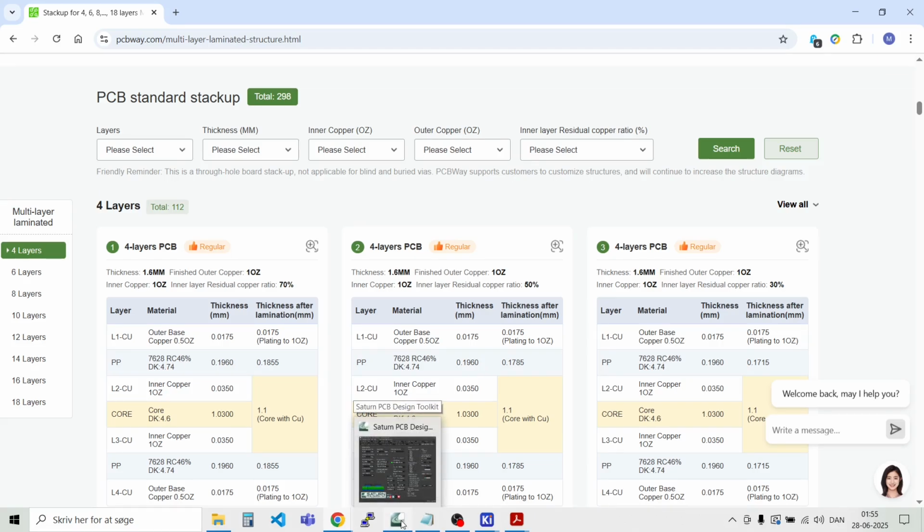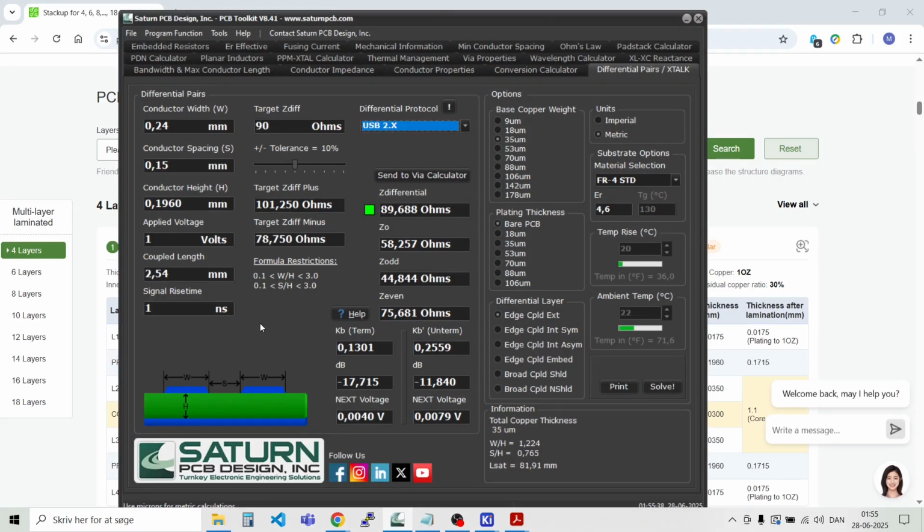And I normally use this tool here. And I also provided the link in the description so that you can also download this tool and make calculations on your tracks to find the correct impedance. So what I selected over here, that I have a USB 2 differential protocol, and I would like to have like 90 ohm impedance on the USB tracks, and then I need to adjust the conductor width and the spacing in between the two signals. You can see how to place them down here.